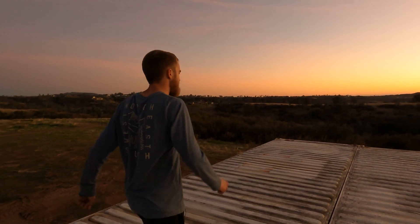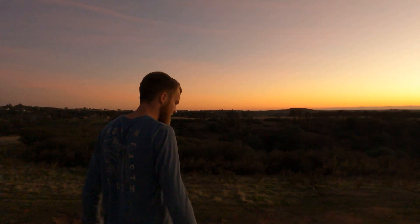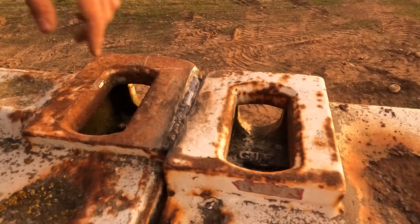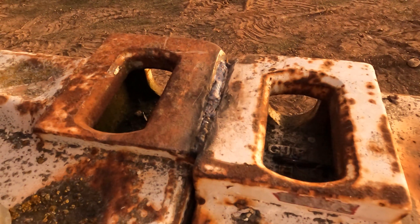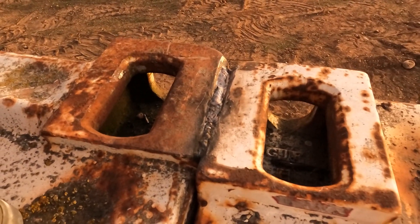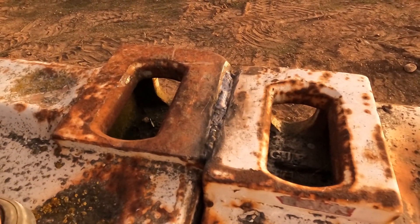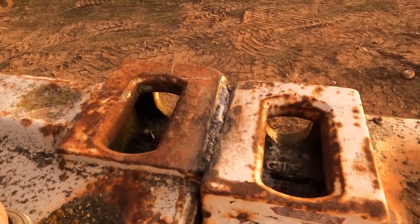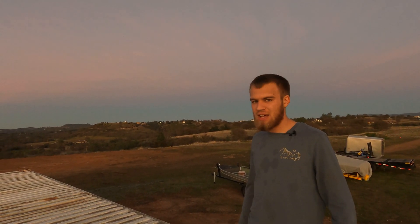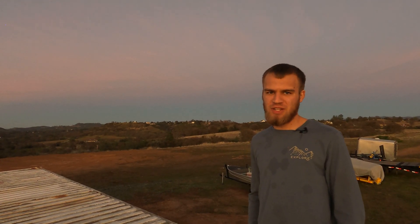Follow me to the other end of the container — we did the exact same thing down there. One thing I didn't mention earlier: we had to cut some chamfers at about 45 degrees on each side. I also switched from 6011 to 7018 for that section. The 6011 section — the messy bird-splatter looking one — I'm probably going to gouge out and re-weld because I'm really not thrilled with how it came together. Other than that, that's about it for today. We still have a lot of welding, cutting, and grinding ahead of us — stay tuned for the next episode. If you're not already subscribed, hit the subscribe button, and be sure to check out my other videos as well as currentconnected.com. See you in the next video!